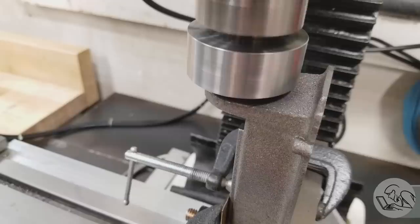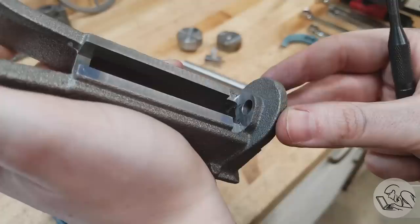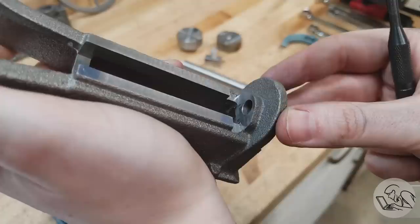This creates a round flat surface for the cylinder to mount on that's extremely square to the crosshead slides — critical, because the cylinder must be mounted square or the engine won't run right. Good excuse to show off my favorite deburring tool: a collapsing inside deburring tool from Noga — link below, I love that thing. The spot face turned out great with that one-time-use fly cutter.